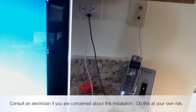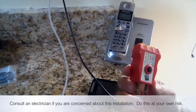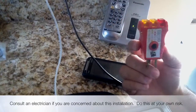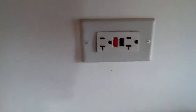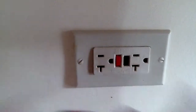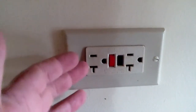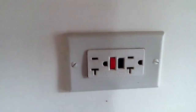Installation took around 10 minutes from beginning to end. The optional circuit tester I showed is great for double-checking your wiring, but if you don't do electrical work you may never use it again — all I really needed was the screwdriver. This outlet connects all the electrical outlets in my kitchen and has a ground fault switch, so if this circuit is tripped, all outlets get tripped. This is why I didn't need to run a ground wire to the other outlet. I would never replace a GFI outlet with this one — it's critical to your house. Find a simple outlet with no GFI to replace instead.